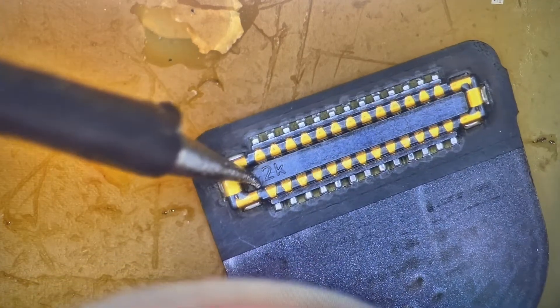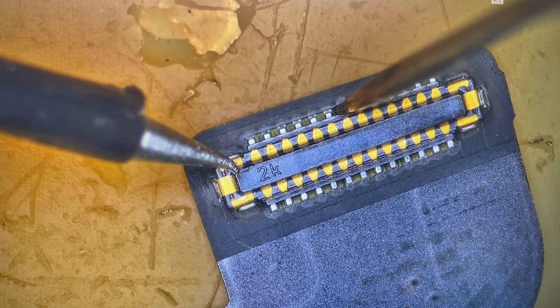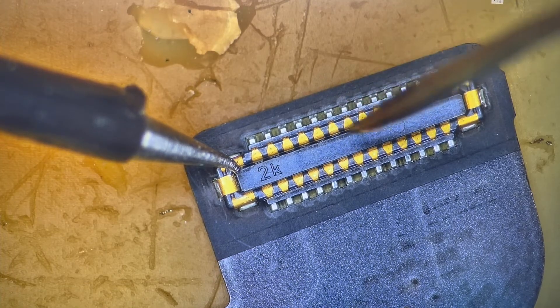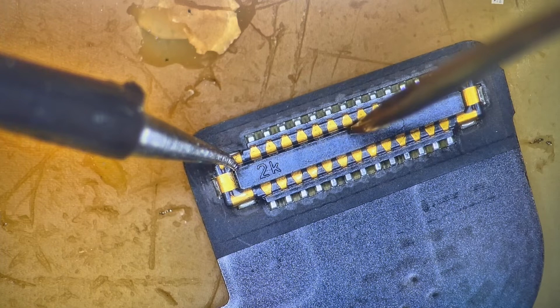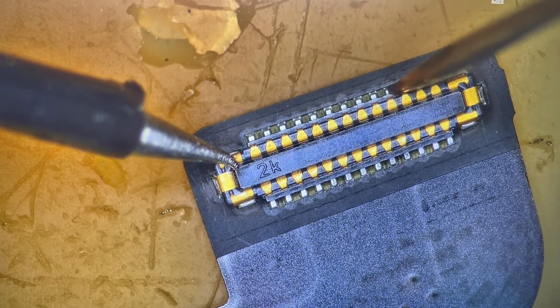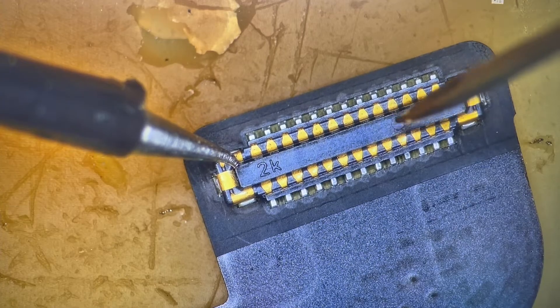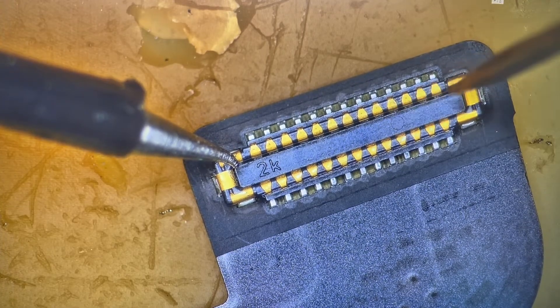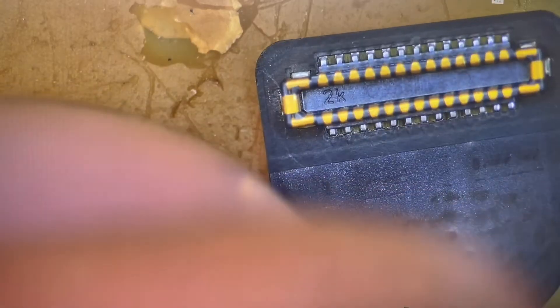This should be ground right here. Let's go around and see if anything else is ground. So this is the ground. And we've got another right here — whatever this is, number four — whatever number four goes to, whatever this fourth pin is, is shorted. Wherever that line goes, we've got contact with ground, but something shorted out.